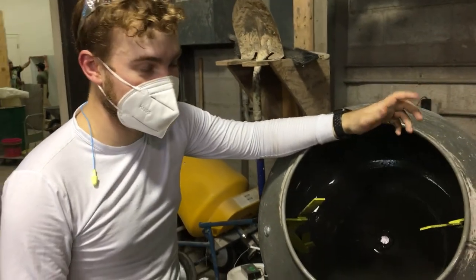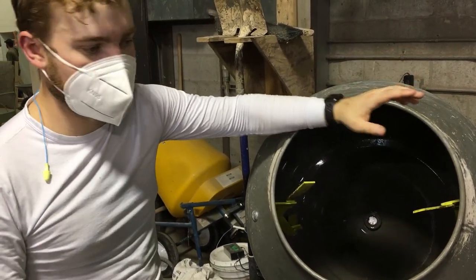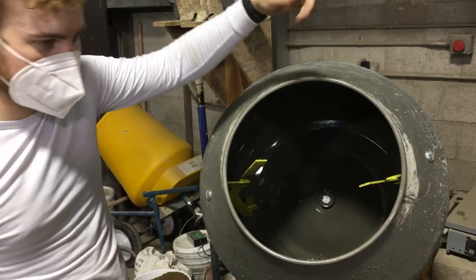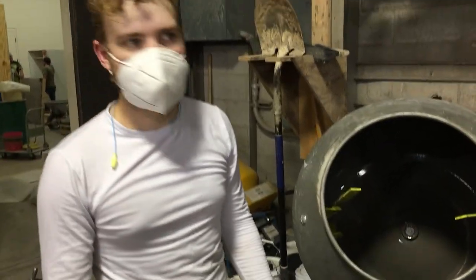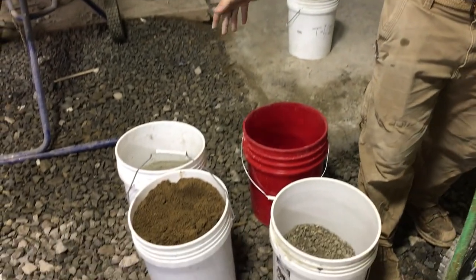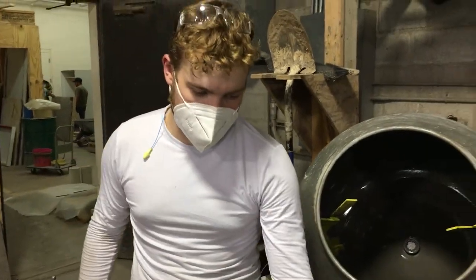ACI standard says that you should butter the mixer beforehand — which is a slurry of cement and water into a very thin paste, mostly water with some cement. They just run it through the mixer, let it rotate some odd revolutions, and dump that out. Now it's buttered, so that the cement won't clump up on there. Once you put your actual weight of cement in, it doesn't ball up — you really don't want that happening, because then it doesn't thoroughly mix into the mass of what you're making.